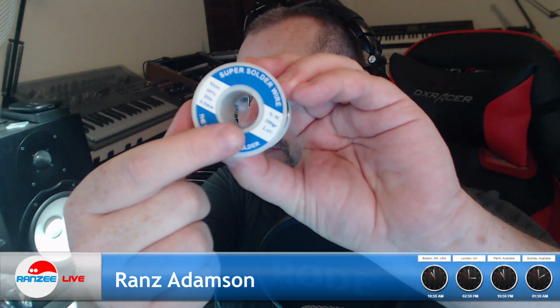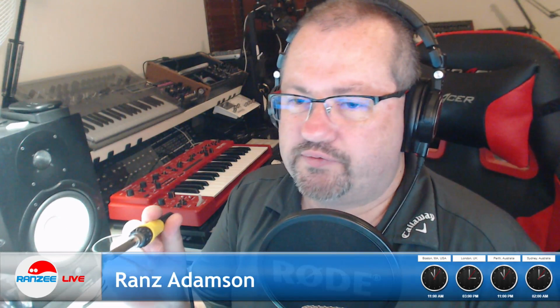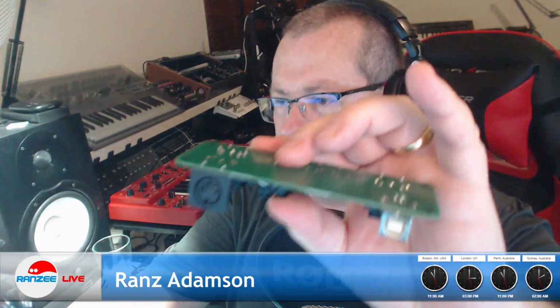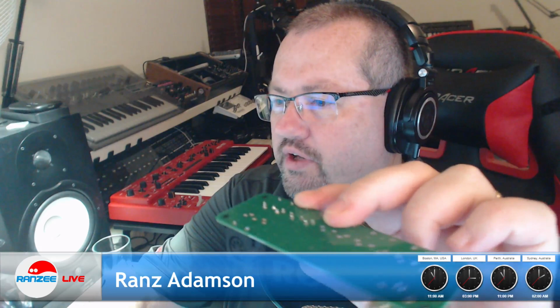But there, 0.5 millimeter. Always use a really thin bit of solder. The thicker your solder, it'll just put crap everywhere. And the other thing too is your actual soldering iron. I always recommend getting one that you can vary the temperature on. Go with a chisel tip if you're doing through-hole soldering, because that tip is flat and it sits on the circuit board, so you can heat up the pin that comes through at the same time. You're putting your stuff through, and then you rest it on the board like that. It just makes it easier to solder.